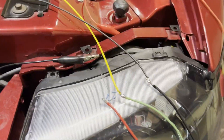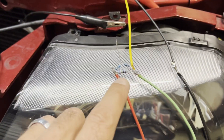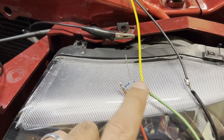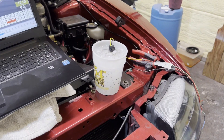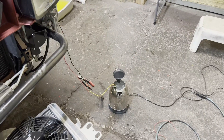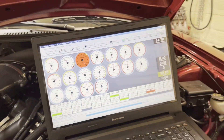I got my temperatures pretty much spot on. I didn't have the exact value I needed so I ended up putting a 6.8kΩ and a 10kΩ resistor in series, then that combination in parallel with the original one, to create the ultimate resistance I needed. Look at that — we actually have an ice-cold temperature sensor that reads ice-cold temperatures perfectly.